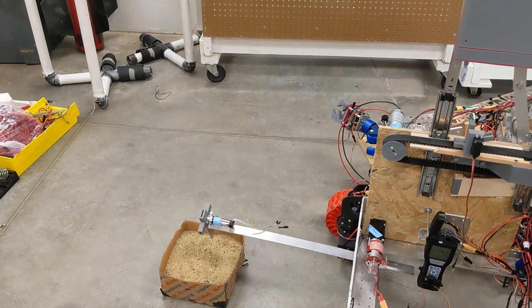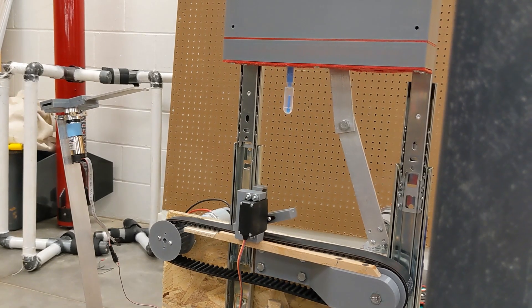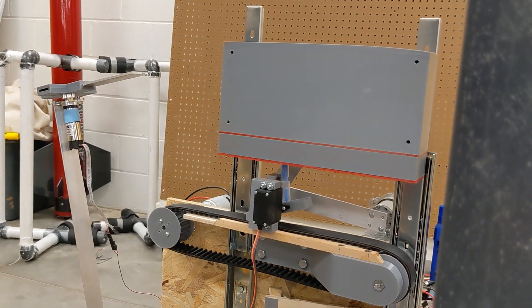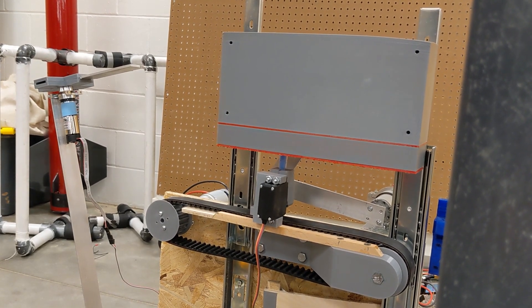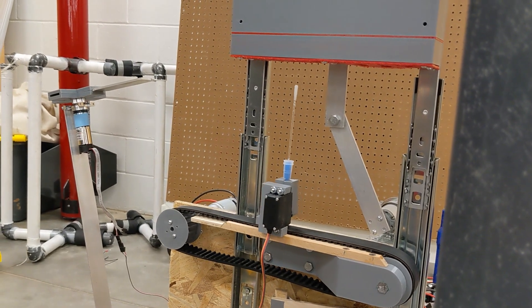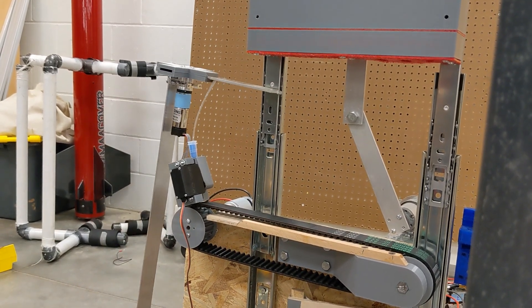The arm component allows us to easily place the sample plates into the soil. The dust and soil covered plates can then be retrieved and swabbed. A swab is grabbed from its folder and wiped across the sample plate to accumulate minute debris. The soiled swab is reinserted into its test tube. Our system will then transfer the swab and place it into the luminometer where it will be analyzed. The luminometer will return a value, definitively indicating that any RLU over 10 has ATP presence, and thus there are signs of extant life.